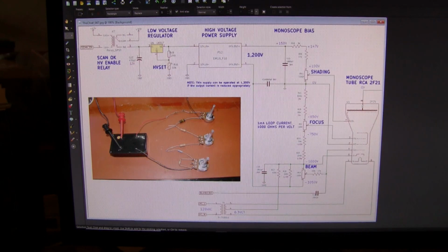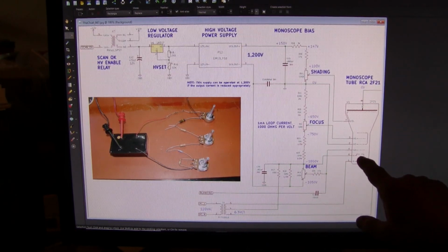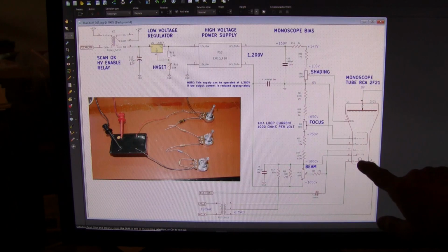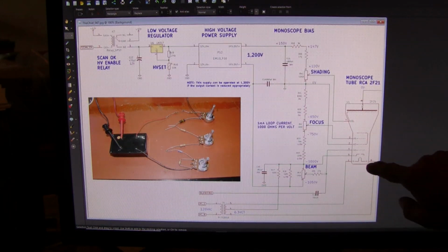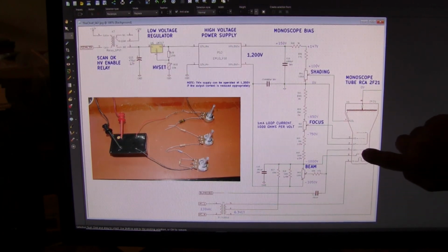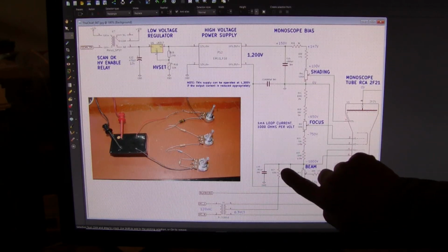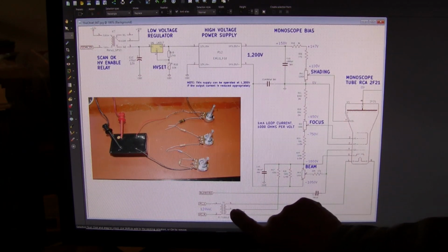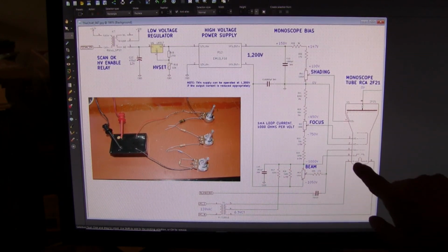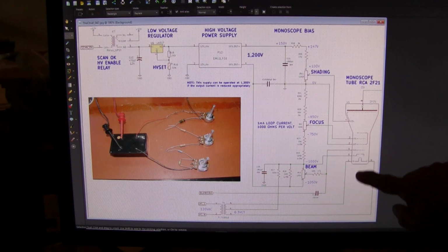Now, another aspect to keep in mind is that the 6-volt heaters are sitting here stuffed up inside a little hollow tube with a flat plate on the end, and they are floating on their own voltage, not related to any of this, running 6 volts through the heater. And therefore there could be, and this is at 1,000 volts negative, arcing from the cathode to the heater elements. To prevent this, I pull the heater down to the minus 1,000 volts using a 100 K reference resistor fed to the center tap of the transformer. This balances the high voltage across the heater so you don't have a hot side and a cooler side. And that's to prevent arcing and for other safety reasons.